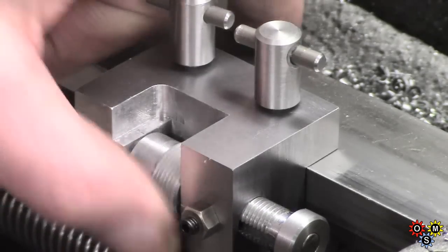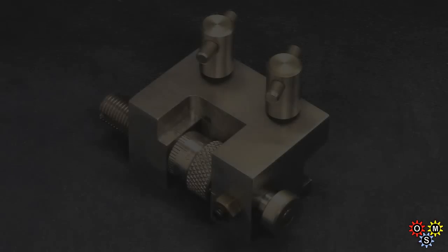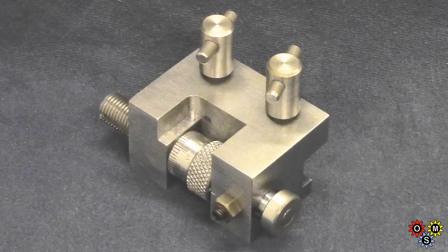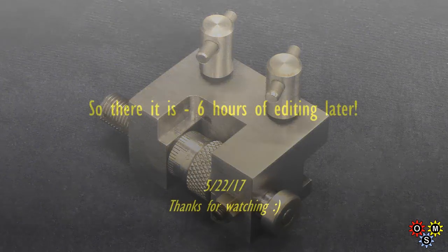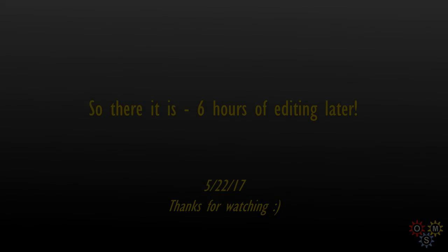I can live with backwards figures — maybe I should make a new vernier, but that may or may not happen. Otherwise, it does exactly what I want — quite a pleasing end result. The securing screws have been shortened slightly, because if the leather disappears, they won't go in far enough for the metal to hit the ways and cause damage. Well, this is all very compressed — hopefully you can follow it all right. We've actually shoehorned about 30 gig of clips into less than 20 minutes. I hope it makes adequate sense. Thank you for watching — we'll see you next time.